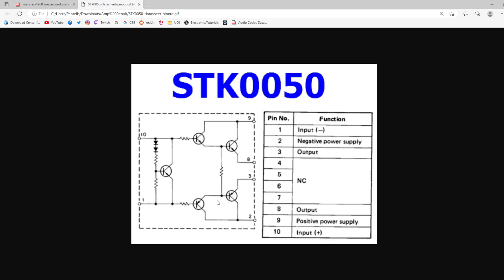On the positive side we had almost zero volts, and while that negative side PNP Darlington got shorted, we had current flowing from the positive resistor to the negative resistor into the minus 40V rail. That blew the resistor on the output and strangely didn't blow the fuse. The next step is to replace the power pack and test again with a new fuse.